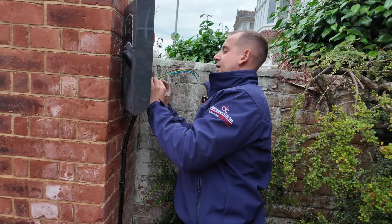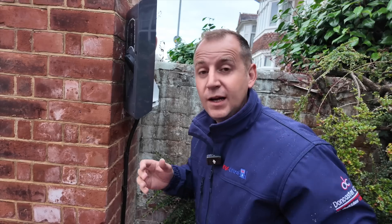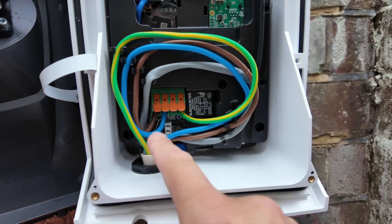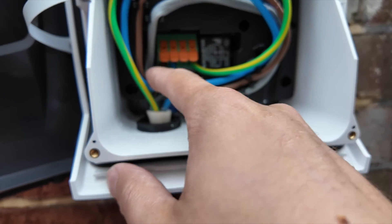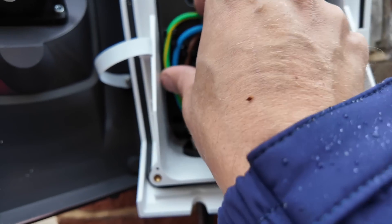They've got these fancy clips but I'm not going to be able to use them all in the preferred order — purely because it's not a new install and I've just got to use the cable length I have. I appreciate this isn't dressed in nicely, but this is the only way I could get it with the CT cable in a clip, running in the lowest one which was actually for the live conductor. All the cables are relatively secure — if it were a new install it would look far better, but it's still going to work the same.